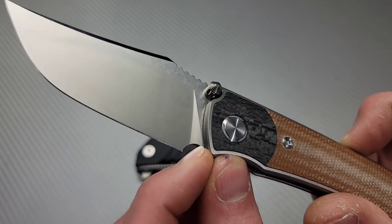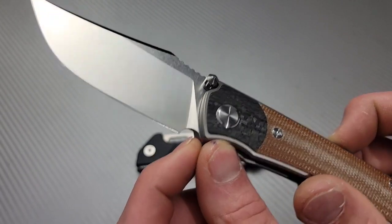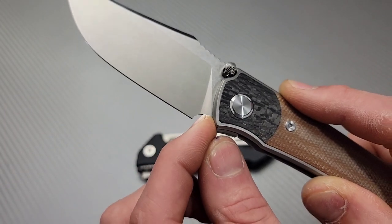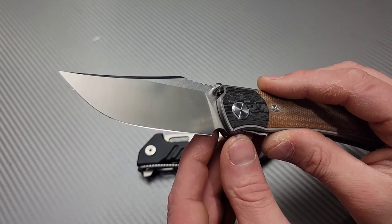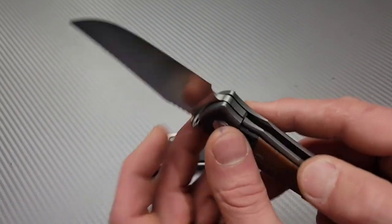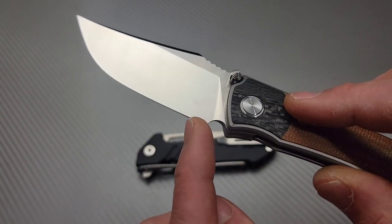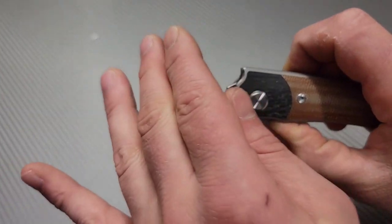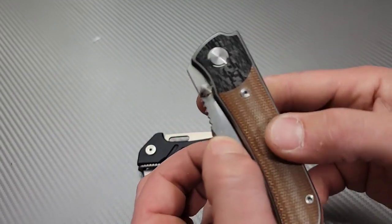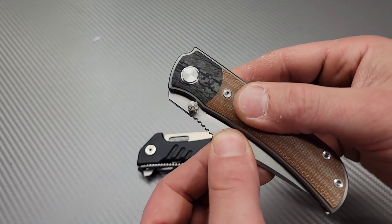Every time the plunge grind starts here, it ends right here and they give you all of this life to sharpen away, which is a lot of life. However, the stop pin does hit on the thickest part of the steel here. If we ever needed to put in a choil on this, or say if this had a bad plunge grind, well then we'd have to leave this spot alone and make sure we did not cut into it — cut in front of it and leave this steel alone. Make sure we don't damage it because that steel stops on this pin to make sure your knife hits the detent and stays locked in. Otherwise it would push past it and it wouldn't set in the detent.